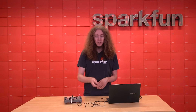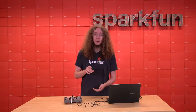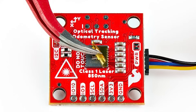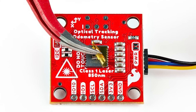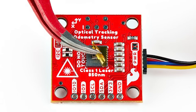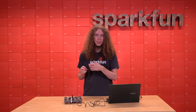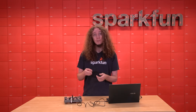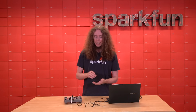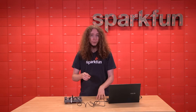Now we'll give some advice on using the optical odometry sensor in order to get the best performance out of it. If you just take it straight out of the box and start playing around with it by hand, you'll get data, but do not expect it to be accurate. The sensor really needs to be mounted correctly, and there's some calibration you need to do. The boards actually ship with a piece of Kapton tape over the optical sensor, which is there to protect it during manufacturing and shipping, but you'll need to remove it since it will absorb some of the laser light. Once you do, try your best to keep the optical sensor clean and avoid touching it, since any gunk on the sensor could cause degraded performance.